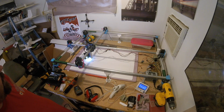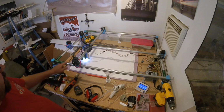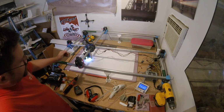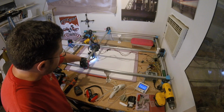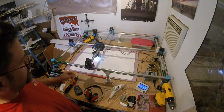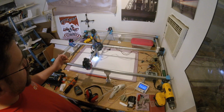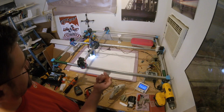There's just minor stuff. The holes for the bearings were a little higher than I wanted them, and there are little nubbins printed on there to stand the bearings off. And there's actually something I want to change on this one still. Either this bearing should be out this way a bit more, or these four should be that way a bit more. Probably the bottom four should be back a bit more, because the needle's going to go through the guide. I could move the guide forward a bit and the top bearing forward a bit, or just move the four bearings back. But the point is, it's not riding in the center of those four guide bearings. It's riding a little closer to the back.